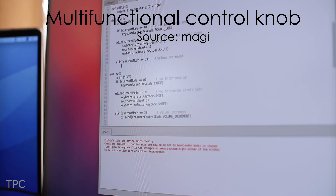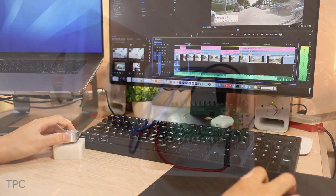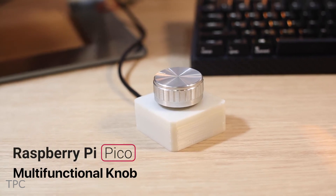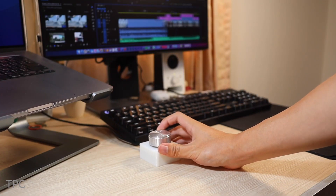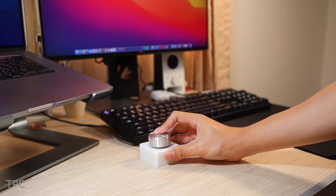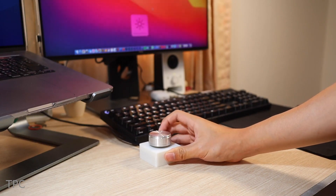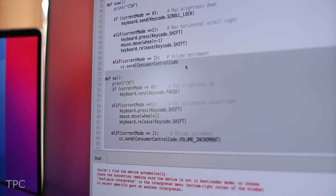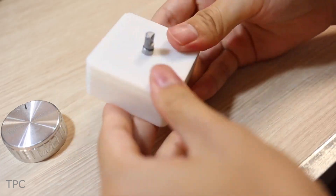Number 7. If you regularly work on your computer, you might know how some shortcuts can save you time. Various shortcut keypads are available online, but this one is simple to build and follow. This multifunctional control knob uses a rotary encoder that will help you scroll horizontally while editing a video. But that doesn't mean you can't use it to control other features like brightness and volume. By pressing the encoder, you can switch between modes, and by modifying the code, you can simulate the button in the way you like. The electronics are enclosed inside a square 3D-printed case, with a knob placed at the top.